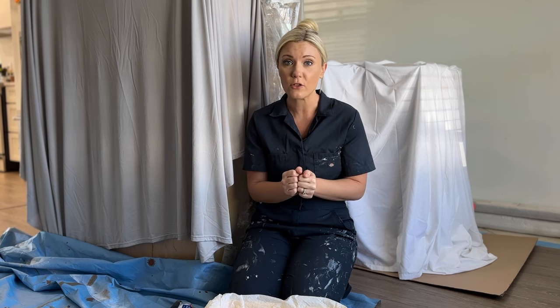I've got my paint roller frame and I'm just going to slide the roller on. I do prefer to put my paint roller frame on an extension rod — this is just a generic one. Typically if you have a broom laying around your house you can unscrew the broom end off and use that rod. I just find the extension rod helps with my back and shoulders and also prevents me from having to climb up and down off a step stool to get the top of the room. My ceilings are only eight feet so it's not a huge reach, but I just prefer the feel of painting walls using the extension rod.